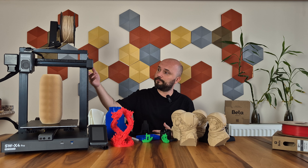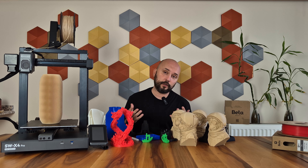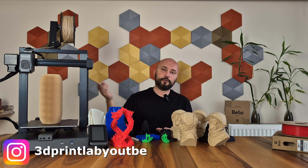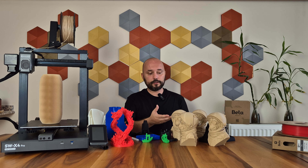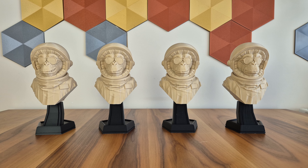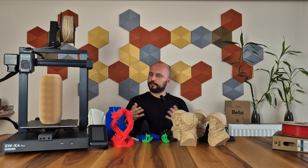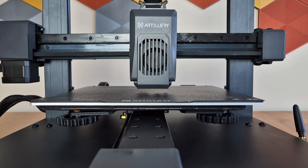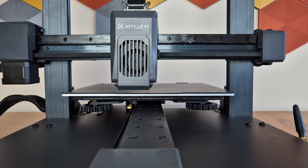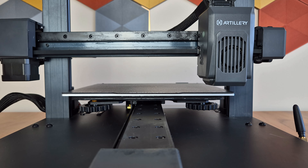The frame is quite sturdy. Linear rails have been used both on the bed and the printing head, and I had mentioned that this was an important factor for me. But I also want to ask why they didn't integrate the vibration sensor into this printer, because the printer uses Klipper software and supports vibration measurement. If you attach a vibration sensor to it, the printer measures the vibration effects at its location and helps reduce the effects caused by vibrations during the process of printing. I think if they had installed this part, much better results could have been achieved, especially in the speed tests. However, at what we can call average speeds of 80-90 mm per second, I did not encounter a problem related to vibration. There is also an aspect of bed leveling that I do not fully understand — why are we doing manual leveling when the nozzle can perform pressure-sensitive and precise measurements? Sure, these systems existed in the past, but the paper leveling process is now over. It is not a difficult task, but I think it would have been much better if they had made the bed fixed and the system fully automatic.